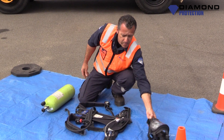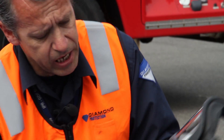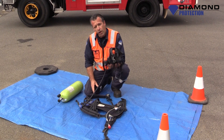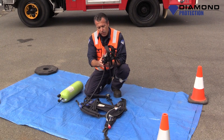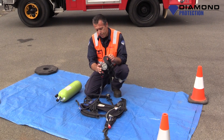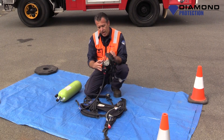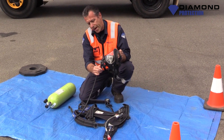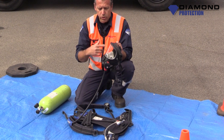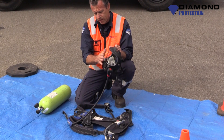After it comes from there, it then goes into the face mask. It clicks into the face mask here just by attaching it to the side and a quarter of a turn. Once you get it in, it locks in and it locks out. On this face mask, once it's hooked onto you, there's a positive pressure. When you start breathing, the demand valve takes the air in as required. There's also a bypass valve, which you turn half a turn, and it'll bypass your demand valve and constantly flow air inside. If it fogs up inside, that's what that's for.